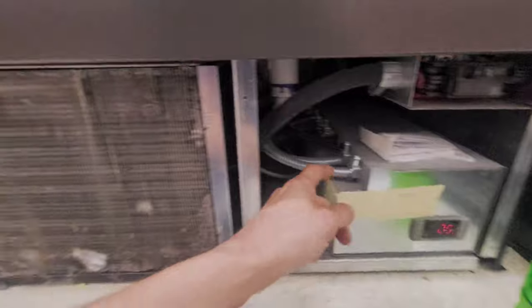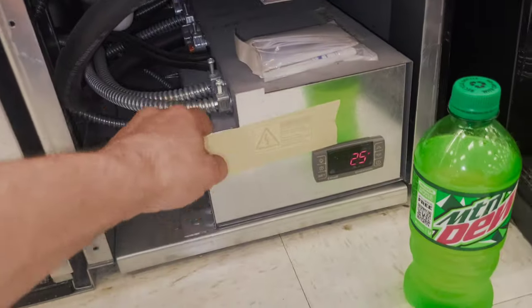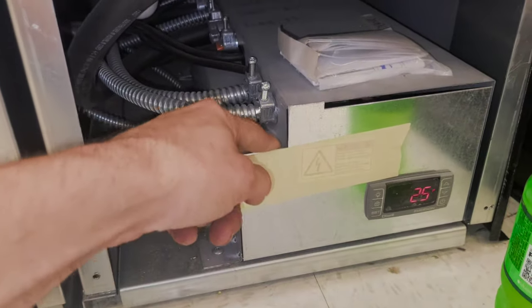This section right here is not working. At first I thought it was refrigerant, but it's not — the compressor's not running. I reached my hand back there to the compressor to feel if it was hot, like out on thermal overload, and it is not hot, it is cold. So I'm hoping I can find an electrical issue in here.